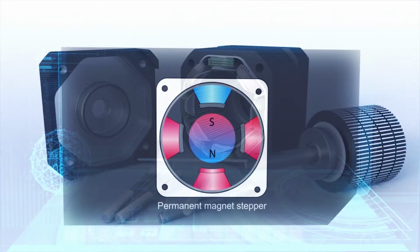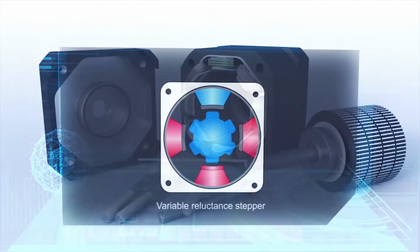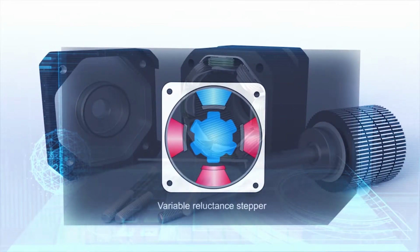Permanent magnet stepper. Permanent magnet motors use a permanent magnet (PM) in the rotor and operate on the attraction or repulsion between the rotor permanent magnet and the stator electromagnets. Variable reluctance stepper. This stepper motor uses a non-magnetized soft iron rotor. The rotor has teeth that are offset from the stator, and as we activate the windings in one particular order, the rotor moves so that it has minimum gap between the stator and the teeth of the rotor.